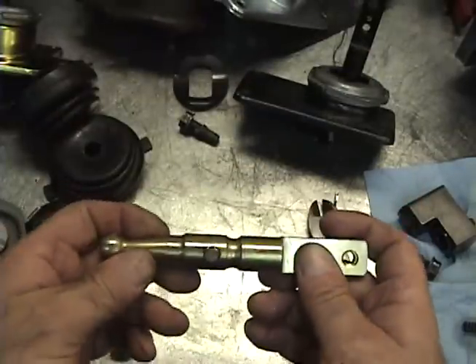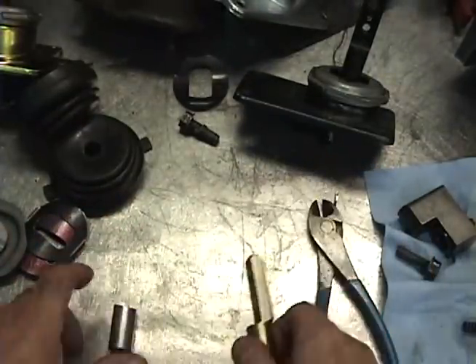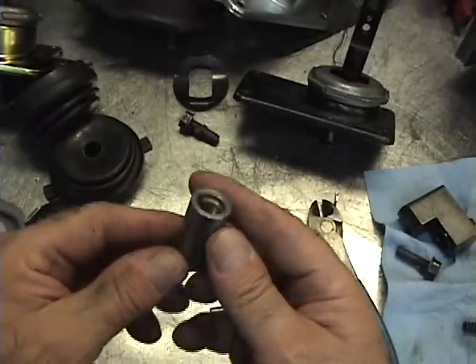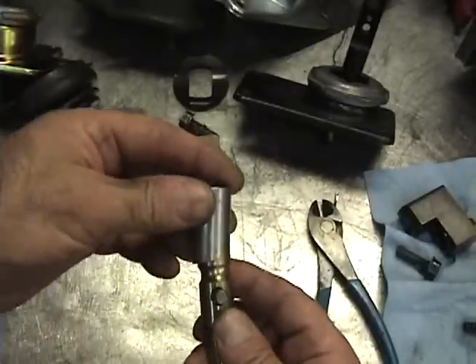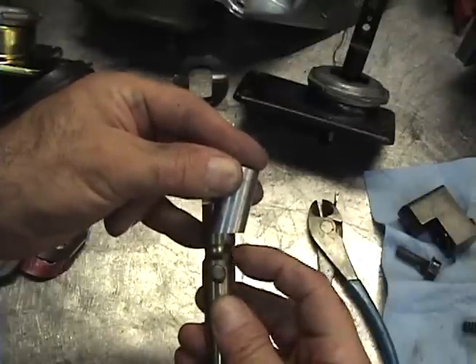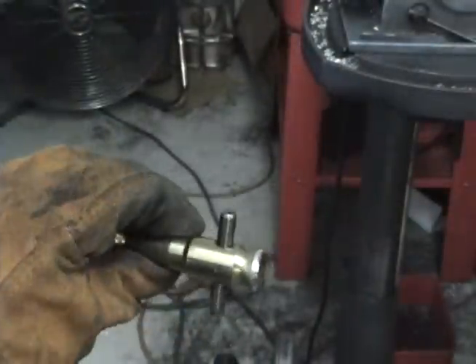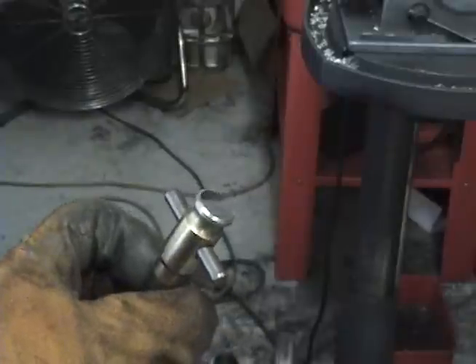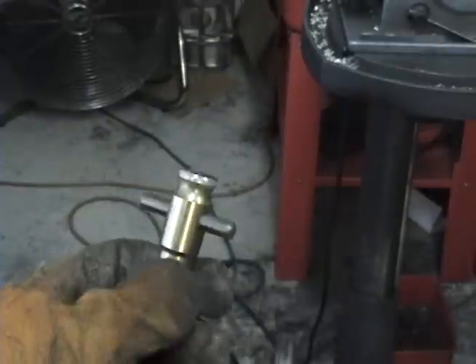So what we're going to do now is take this stick and cut this end off on a chop saw. I make these nice little ferrules that have an angle already built into them. I'm going to cut this off, weld this piece on here, and usually offset them so that I get a good fillet weld on either side for strength. After chopping it off on the chop saw, if it doesn't chop off straight, you can use the hand grinder and clean it up — but this looks pretty good.